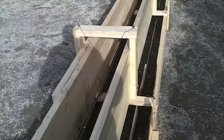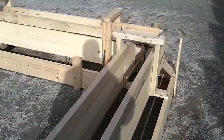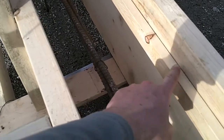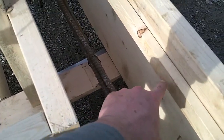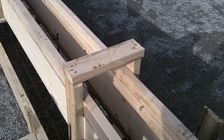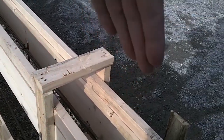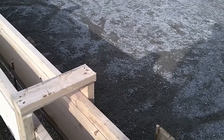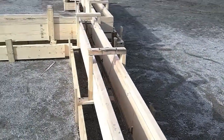You can see all that's in, and on the exterior wall we have what's called a pour strip — you can see this strip right here. They'll pour up to the top of that, and what that'll do is make a nice little indent in our finished concrete so that we can actually wrap our siding just down to it. It actually looks nice and clean; it's a great way to do it.